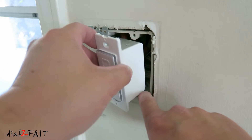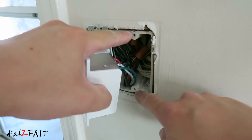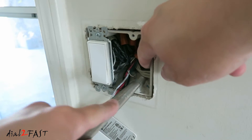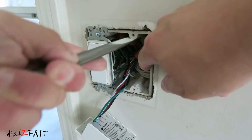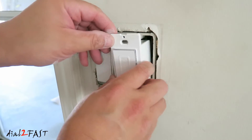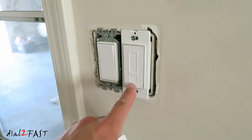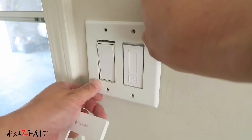I'm seeing a problem with installing this switch into this box — the switch itself is too big, and these two screw holes are getting in the way. To make this work, what I'll do is file the bottom side and the top side here so this switch will fit. With the bottom and top filed down, let's try fitting the switch again. Install the two screws that came with the switch. Now if you only have one switch, install the switch plate that came with the dimmer. Since I have two switches, I'll be installing the wall plate that I had before.